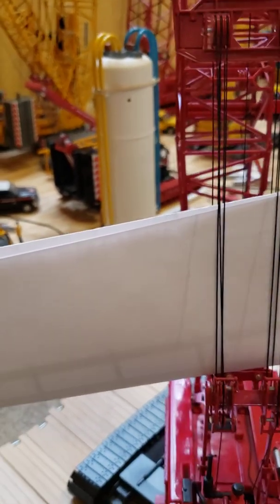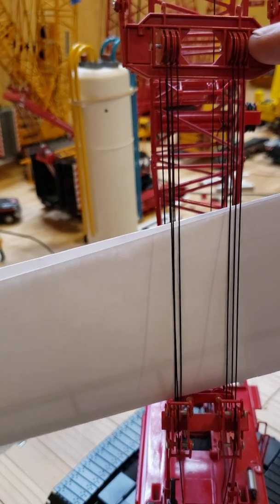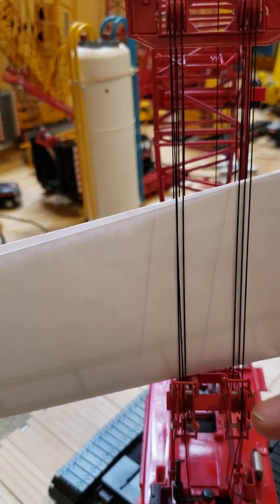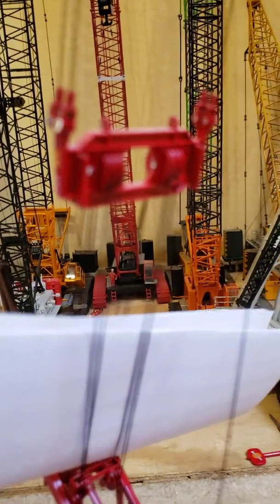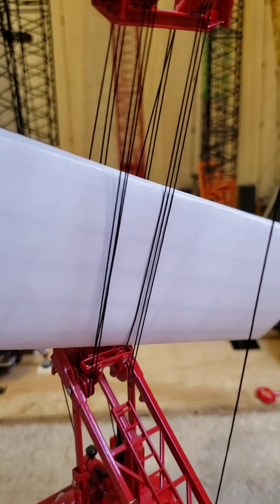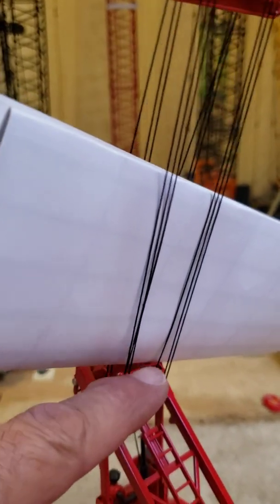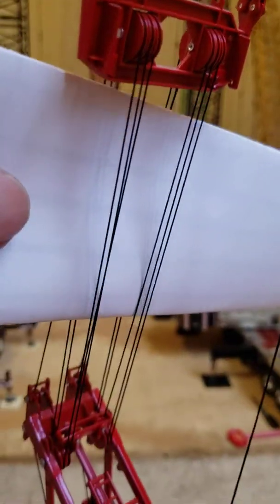Just pay attention to what pulley you're on and where you're coming from — it was pretty easy. The manual does not give any reeving for this thing. You can see how this first one comes from down here out of the drum, comes to this first pulley, and you just wind around these pulleys until you get to the inside and get to the crossover, and then it's just the same thing up on the other side. Don't feel like it's impossible to do — it is very simple and very easy. You can clearly see this coming out of the equalizer going up to that first pulley, and you can see how everything goes straight.